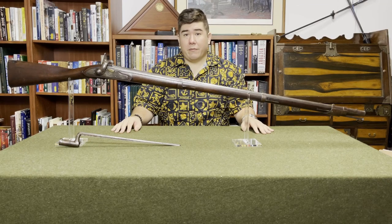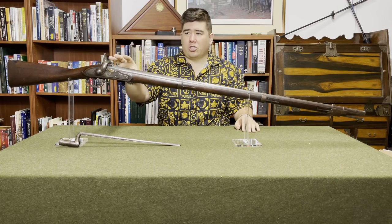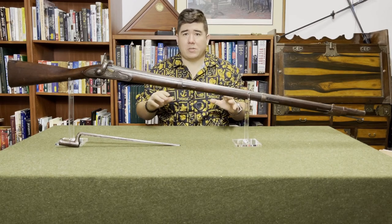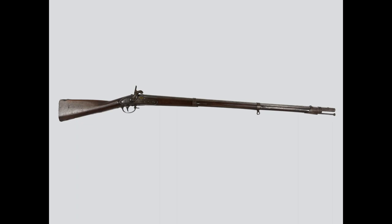So that's about everything for this — let's get it over to the light box and I can highlight specific features, and do a comparison on the percussion conversion and flintlock, which will be a separate episode when I go in depth. Starting out on the right side of the musket, at first glance it looks very much the same as any other Charleville-derived musket. The barrel bands are the same, the band springs have moved, the brass pan is there. Obviously this one looks a lot different because it's a percussion conversion, but the key differences between this and the previous Charleville patterns are minor stock dimension changes and the shape of the lock panel, which doesn't have quite the same point the old one did.